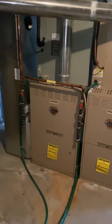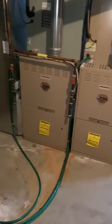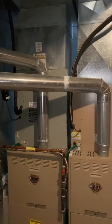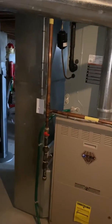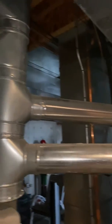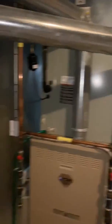At Kirsten's aunt's house, we're going to do a replacement of a furnace here. We'll pull the furnace out, set our new furnace in place on top of a six-inch furnace base, build into the existing air conditioning coil, and reuse everything up above that. Gas lines are copper into black iron — we'll just rebuild into the new system. The flue pipe is four-inch into five-inch and runs into this five-inch swivel tee, so we'll replace from the five-inch right there back down to the new system.